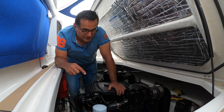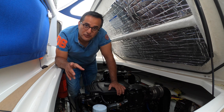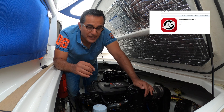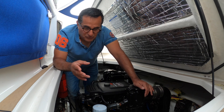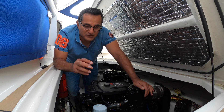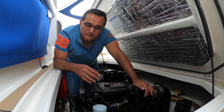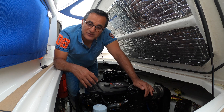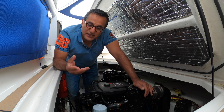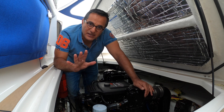The first thing I purchased for this boat was the Vessel View module. This module connects to the SmartCraft MerCruiser and sends information via Bluetooth to your iPhone through a dedicated MerCruiser application. You get very good information: maintenance data, speed, fuel consumption, RPM — whatever you want from the engine. You can make screenshots and send them to your maintenance team, and it also shows fault codes. However, because I invested in an MFD Garmin chart plotter, I want to use its full functionalities. I thought the Vessel View could also connect to NMEA 2000, but it doesn't work that way.